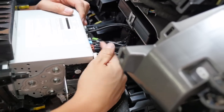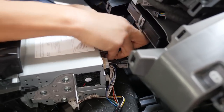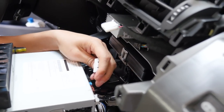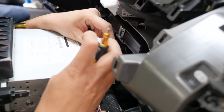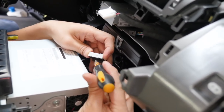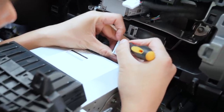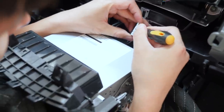Next, we're going to work on the middle 30-pin connector. Same as with the 28-pin, we're going to break this into halves. For this one, you're also going to want to remove the very bottom row. Be very, very gentle — we don't want to deform the connector in any way.